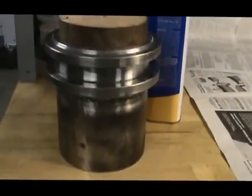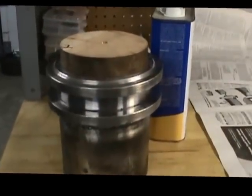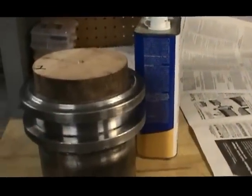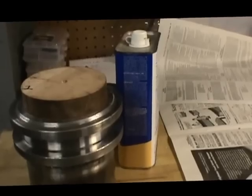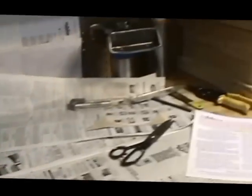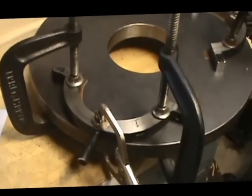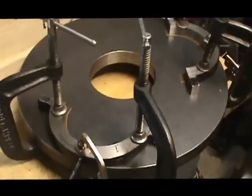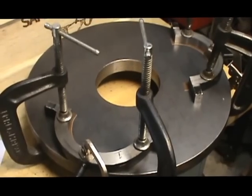This is the hub of the clutch assembly once it's all fabricated, and that shifting collar rides in this groove right here. So the diameter in here is slightly smaller than the bore of the shifting collar when assembled, including the thickness of the Teflon once it's applied in there. So I'm going to go ahead and use the shifting, not the shifting collar, but the hub over here.